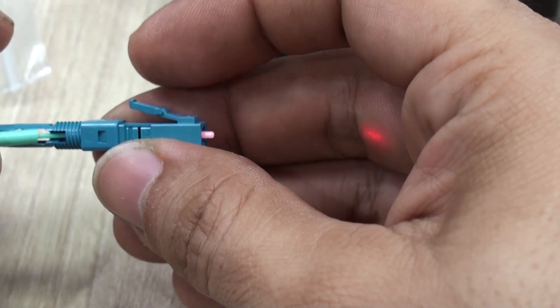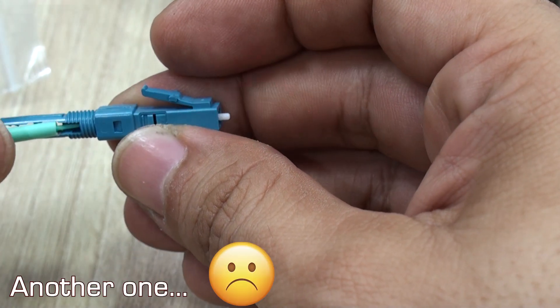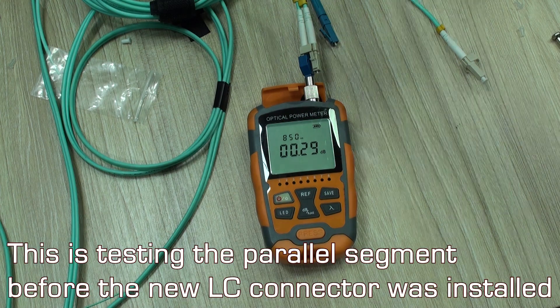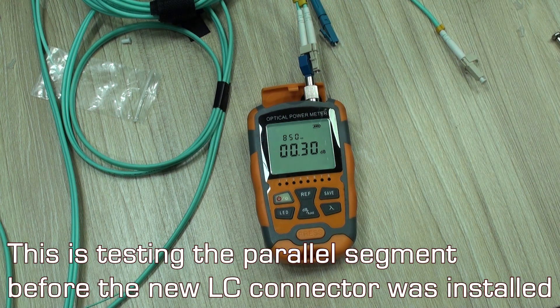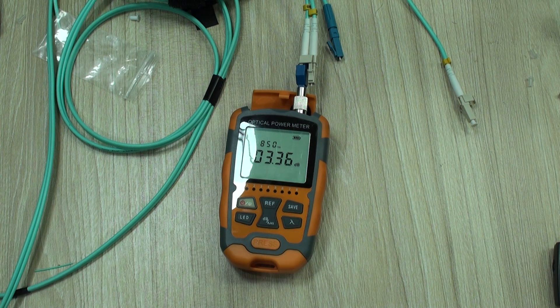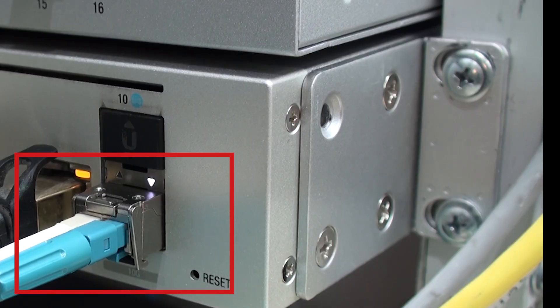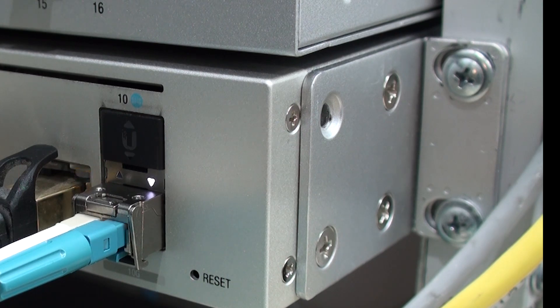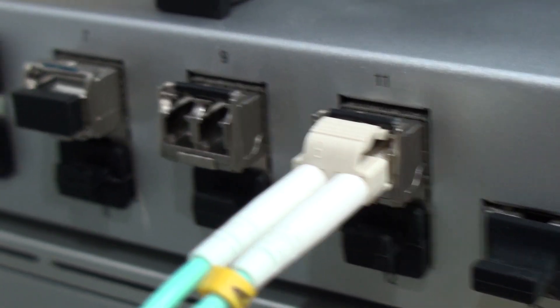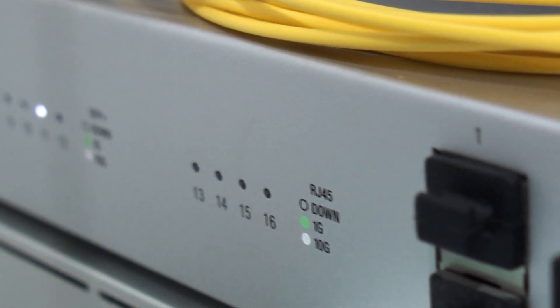As always, you're going to need to invest money in your own training. You can then use your fiber optic power meter to test how much signal loss was added to your system. In my case I ended up with three decibels of added signal loss, which is too much — it should have read less than one. However, for my 25-meter run of 10 gigabit per second connection over OM3, it was not noticeable. For longer runs I would not have accepted it. I think I may have ended up leaving a small gap inside the connector in this particular case.